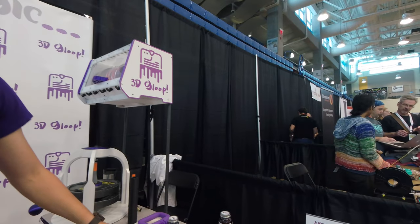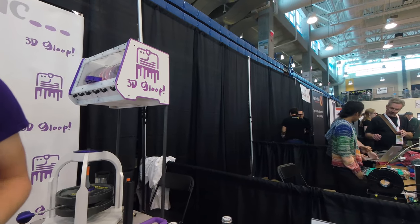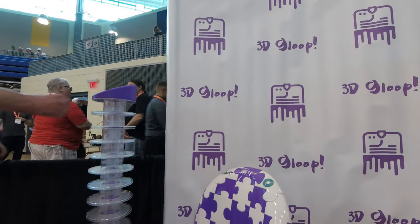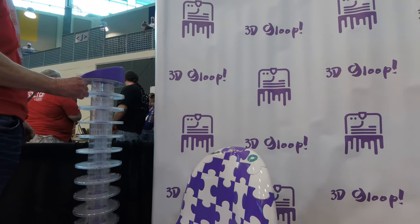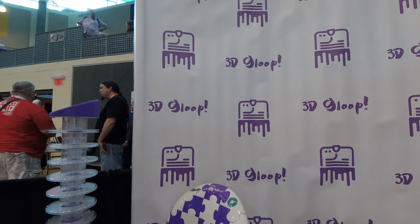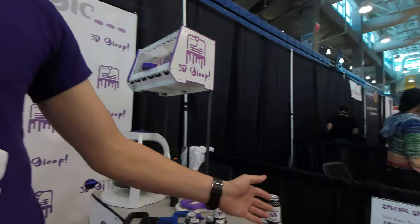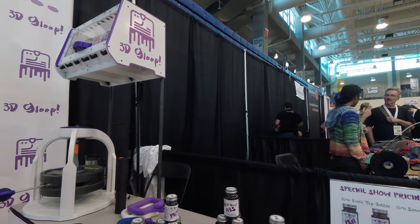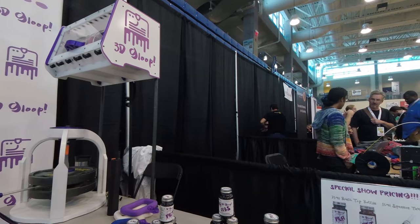We're just releasing our PET formula, which works on co-polyesters and PETG. We've got this chair over here — that's printed out of 105 different pieces of PETG. We partnered with Polymaker; they supplied the filament so we could do this, and we glooped it together with our new Gloop. We also offer our original product, the PLA and ABS, and we still have our PLA Glue Gloop, which is a thick version of our glue and it's only for gluing parts together.